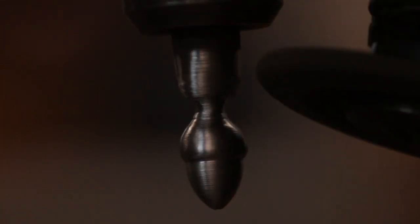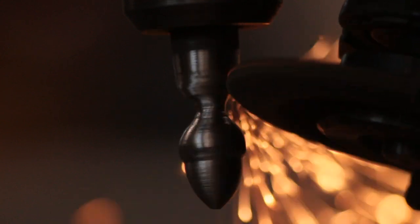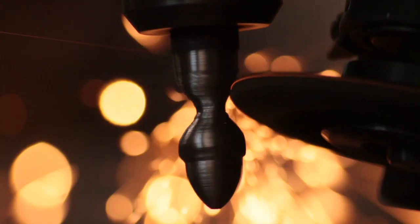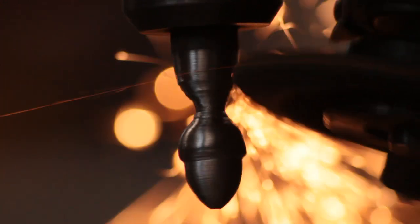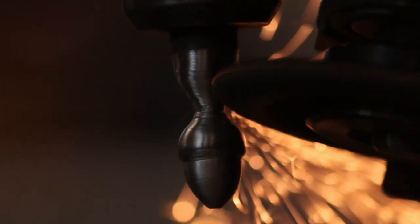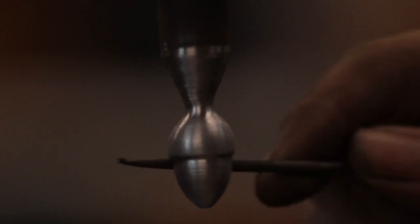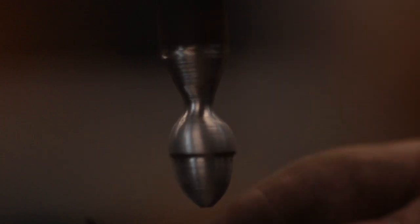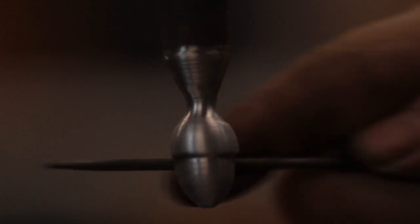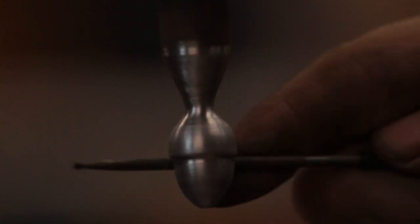I'll start grinding the cup now. I'm going quite deep here and you can see it's a bit uneven — it's kicking the grinder about a bit, but it can be sorted out afterwards. You want a short stubby taper leading from the parent bar to the acorn itself as well, and that'll just allow you to feed the material in a bit easier and make for a better transition when you're making your acorns.